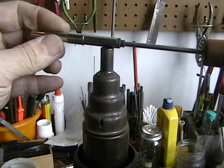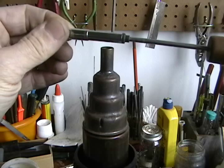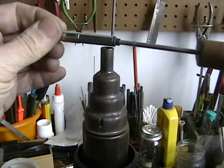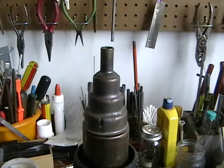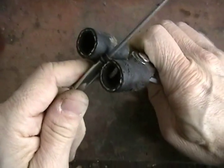First, though, we want to apply some heat. The heat should be directed onto the metal rather than onto the end plug. It doesn't take much. Once the end of the converter is hot to the touch, grip the plug firmly with your padded pliers and wiggle it out.